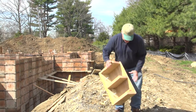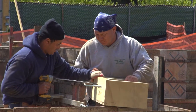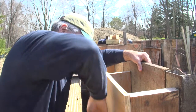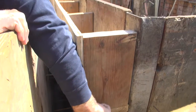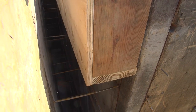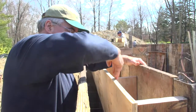This is an example of some of the formwork that goes into place in between the modular framework. The concrete will go down in this area, fill up to here, and fill around down into that area there. You'll have a step left over where all of our floor joists are going to run into this area.